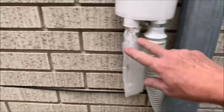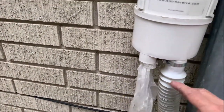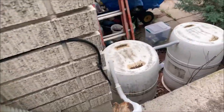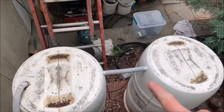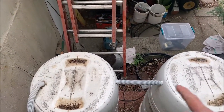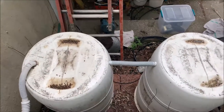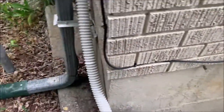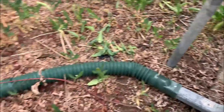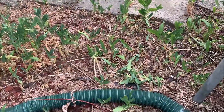I'm not really thrilled with this system but it is one way that you can do it. It has two outlets — I've got one of them blocked off, redneck farm style. This hose goes down to these 50-gallon drums, and I've got an extension so it'll fill this drum. These are just siliconed in. When you're not using the collection system and you throw the switch, it just runs out and waters some of my landscaping. Let me go down to the bottom and show you what that looks like.